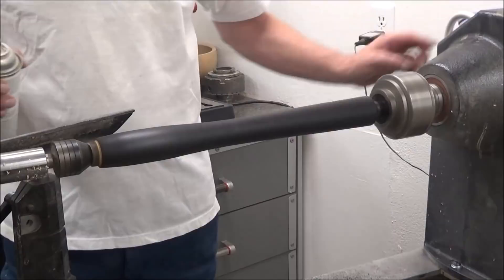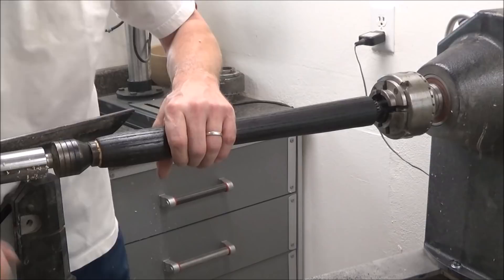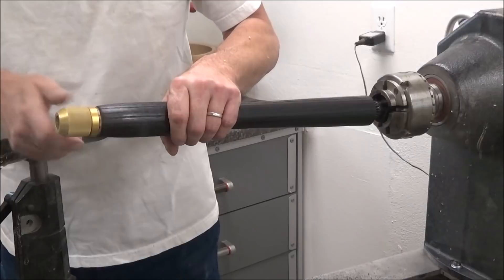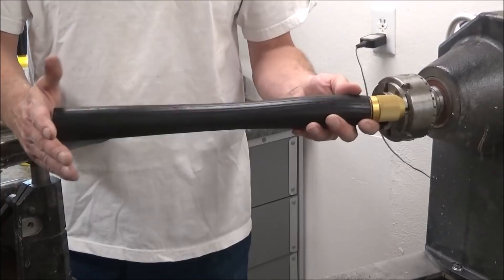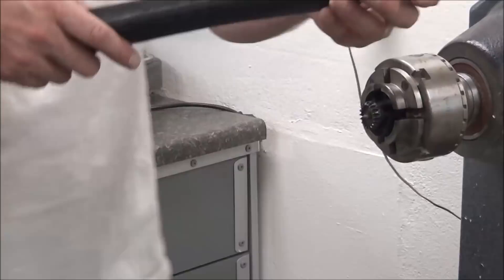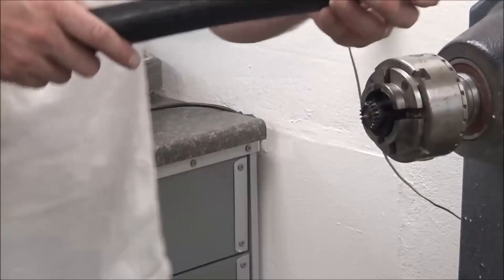That's dry to the touch now and the handle's still hot. Take this away, hold that in place — that is tapped onto there, and that sits into there. There you go — there's your quick release handle. I make the standard size 16 inches, and the longer size for hollowing tools, mermaid tools, whatever — I make them 22 inches. You want that leverage. This is a nice handle: you're holding the tool here, you can hold it there, and you can get the tool into your body — located three places. That's as easy as that. Hope you enjoyed it. See you later.